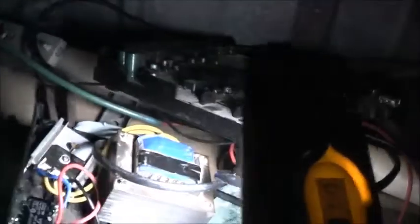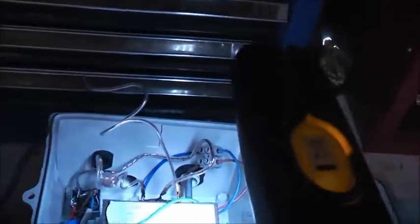Now I could use this four-amp transformer, but it only outputs 12 to 14 volts — the voltage is too low. I need at least 24 to 36 volts out of this power supply, which is why I chose the other transformer in the first place. Anyway, it smells nice and toasty, like magic smoke. It's just the secondary that failed, so I'll pull it apart one day and rewind it and see what voltages and current we can get. That'll be interesting to see. Anyway, that's enough for now, thanks for watching.